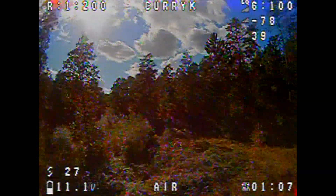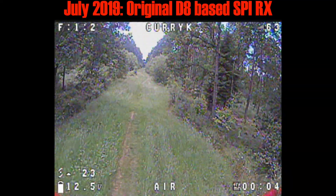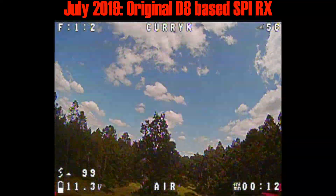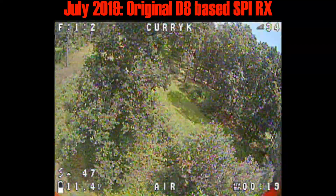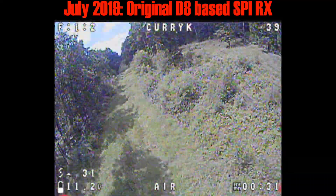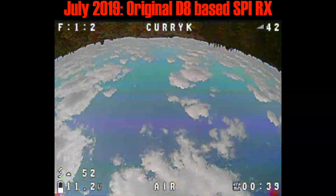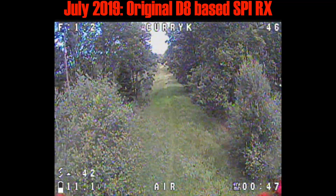To illustrate the difference, here's some old footage — the original test of this model with the SPI receiver from July 2019. Better camera conditions but look at that RSSI — it's just dropping like a stone. I'm right there facing sideways, trying to get the best position, but you can see it's in the 30s just going around a tree. I was worried about losing signal. It's fair to say SPI receivers do run a much lower RSSI than a regular FrSky receiver — these will go down to something like 20, and it's just so unpredictable about when they're going to lose signal completely.